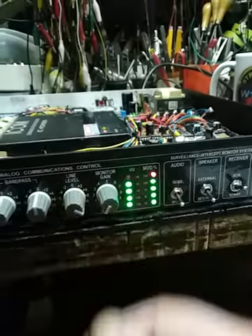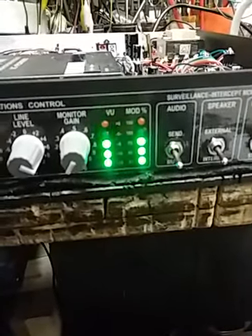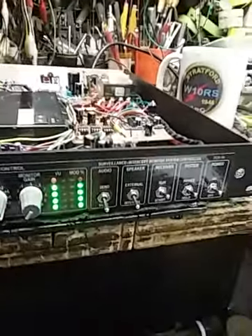If there's more than 50% overload, all the greens will blank out. As you can see — that's serious overload, just measuring the peaks. Right next to it, average modulation is a three-second integration to tell you how much energy is in the carrier. If you're an AM guy, you're going to want to know that. This is talk radio right now, so you're not going to see a completely full envelope.